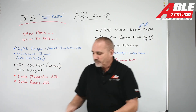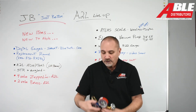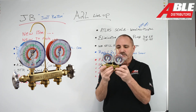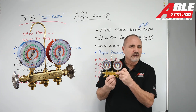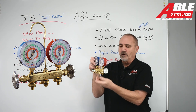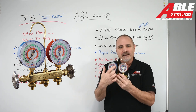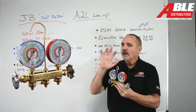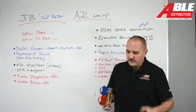If you're not going to spin in new gauges, another economical way — and I like these a lot — is just a simple two-valve brass setup. You've got a port for adding refrigerant to go to your jug, and you could pull a vacuum through it too. Then you have your hoses. The beauty about this is you can put the hose front or back because the connections pivot. Simple, down and dirty. These are the A2L versions, so they show R32, R410, and R454. We still have older gauges in stock if you need them showing R22.